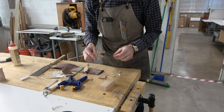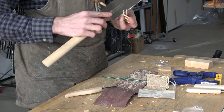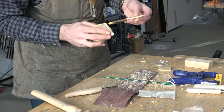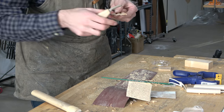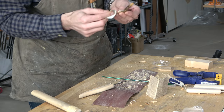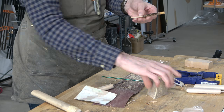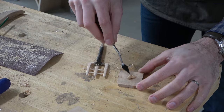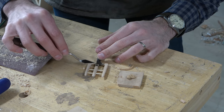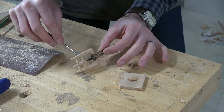After giving the glue a few hours, I can come back and take it out of the clamps and see how it has held up. I want to do this before the glue is completely hardened and dry, because if I need to break the joint open — if it didn't bond in the right position — it is easier to do now than once the glue has fully set. There is still more shaping to happen; I need to make sure those transitions between the old and the new are really smooth. Back to the carving knife, back to the sandpaper, and more working. I had no idea that something so small and seemingly insignificant would consume so much time. Once I am satisfied with the rough shape, I will come back with some wood filler on the edges — just where I couldn't get the sandpaper all the way in — and make sure I have a nice smooth transition. Ultimately, I want this to be invisible; I don't want anyone to see this repair.